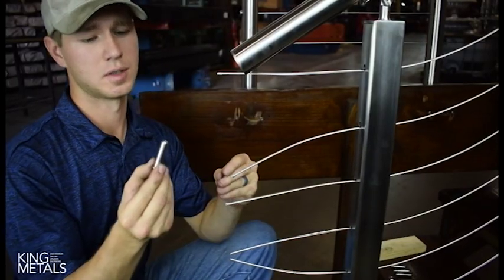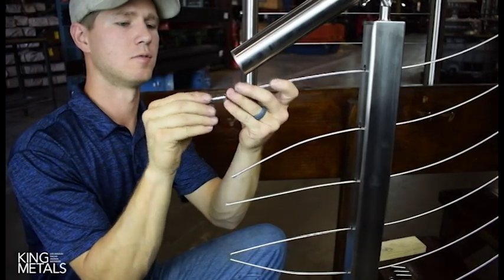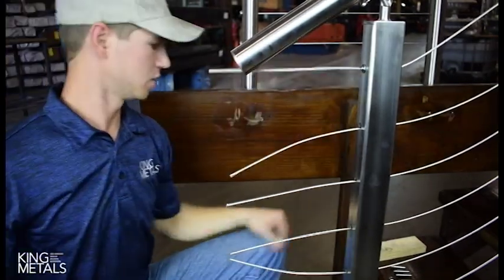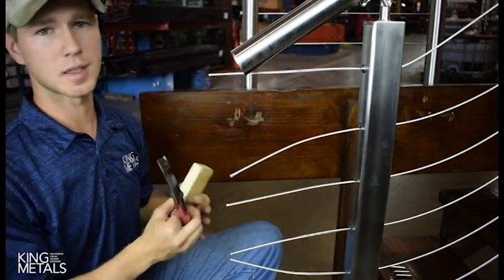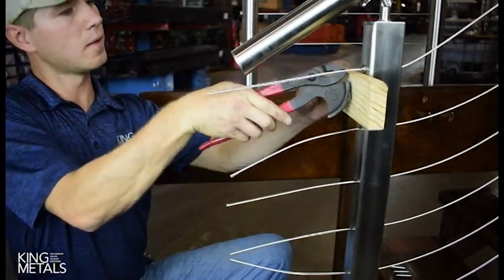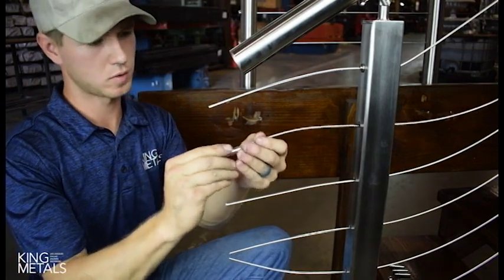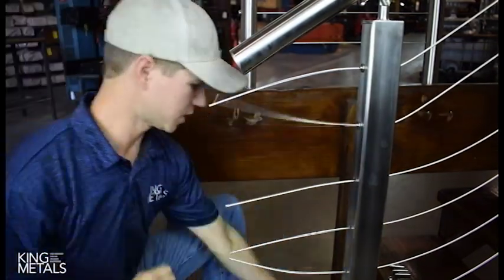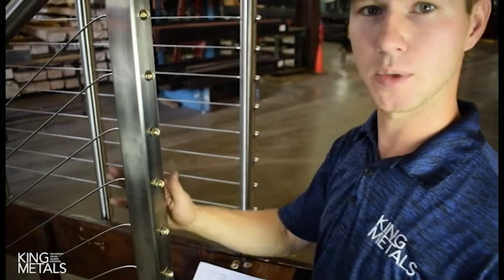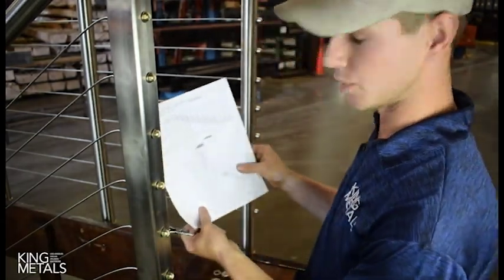You want to cut your locking end. Take the black washer, put it over the shaft, and pull it hand tight. Get your tensioning pliers that come in your kit and a piece of wood — anything will work just to protect your steel. Grab it and pull it tight. Continue working your way down. Once you get all cables hand tight, get your tensioning sheet, your Allen wrench, and your hand wrench, and follow the order in which you need to tighten.